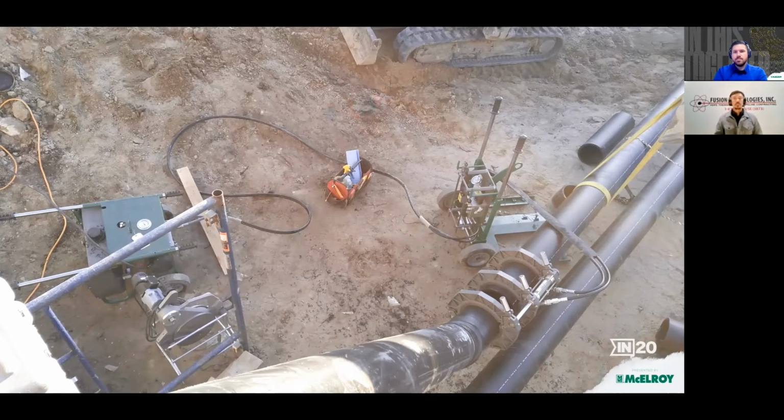So in between fusions, when you disconnect your hydraulic couplings from the top works, there's no trapped pressure in those hoses and you can easily reconnect. Anyone who's worked with hydraulic equipment with auxiliary attachments knows how frustrating it usually is if the machine doesn't go through the process to properly bleed down the hydraulic pressure. Then there's trapped pressure and you cannot get those QDs to work. So we never had an issue with that on this equipment.